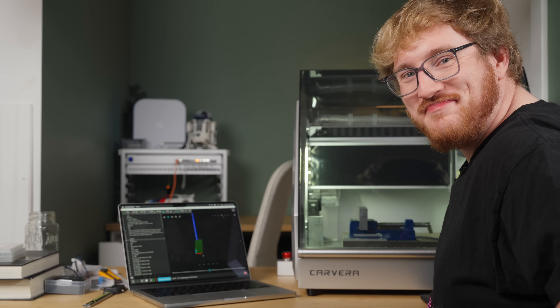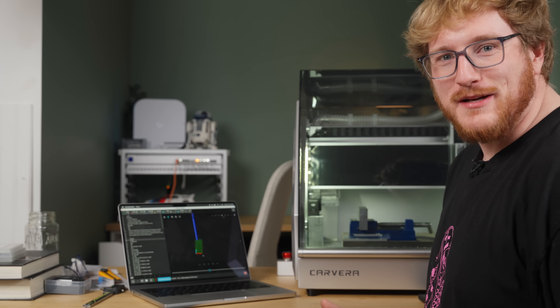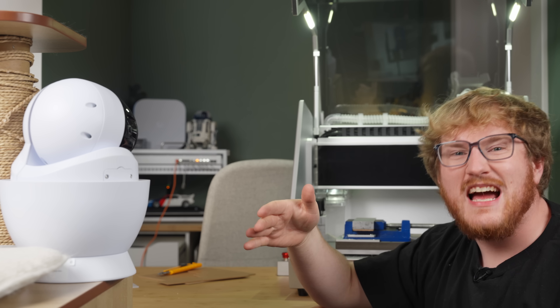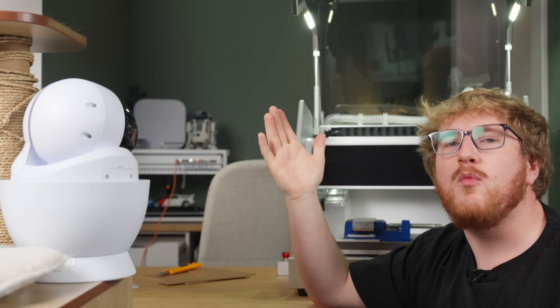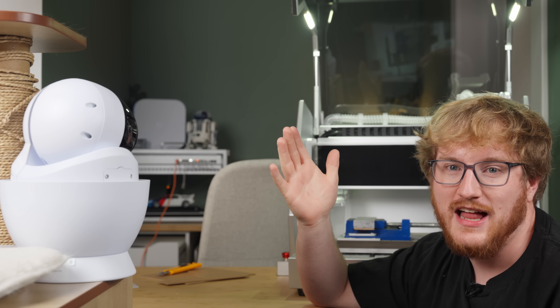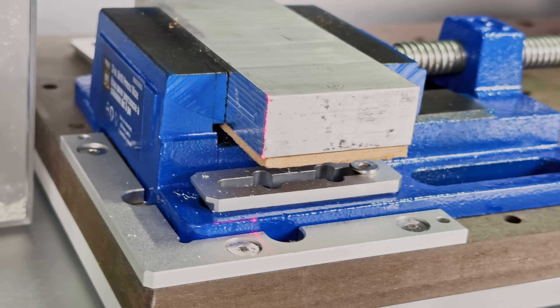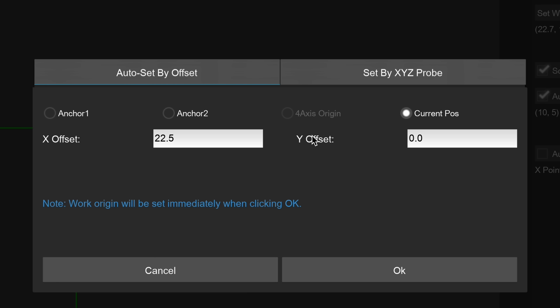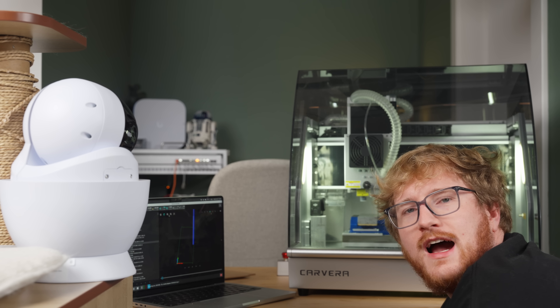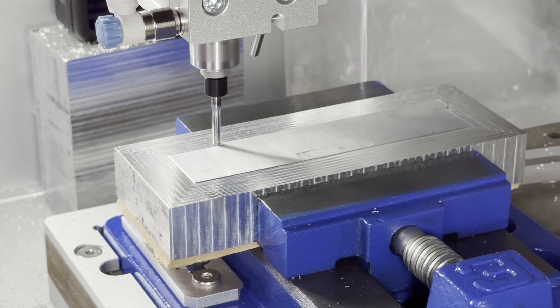I'm having a blast. I've got a 3D printer with a tool changer — the Prusa XL — and now I've got a desktop CNC with a tool changer. It's so cool. And this time, since I care about the design being centered, I'm going to use the probe to mark out the origin corner instead of guessing with the calipers. We've got it super closely lined up on the corner. We go to our file, start running, set our work origin to current position. But I took like 2 millimeters off the side to clean it up, which means this whole design is going to be 2 millimeters off now.